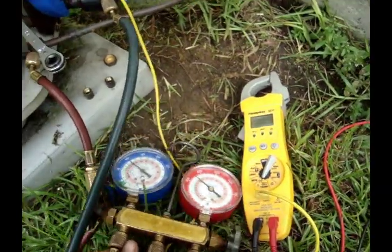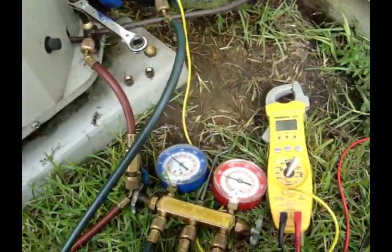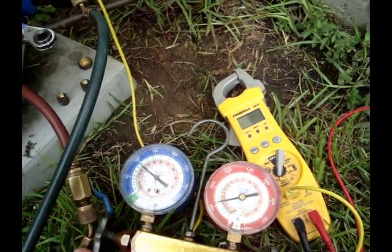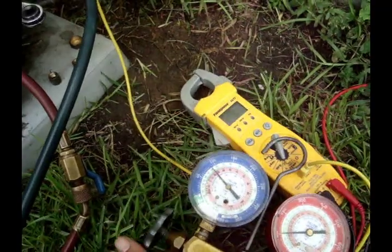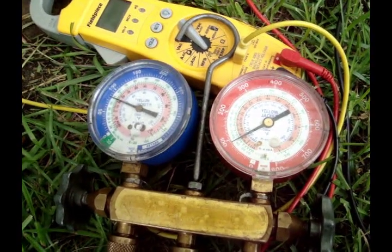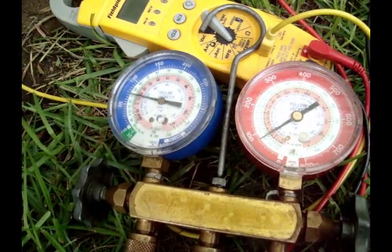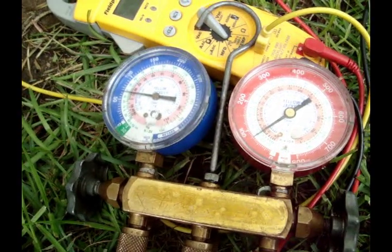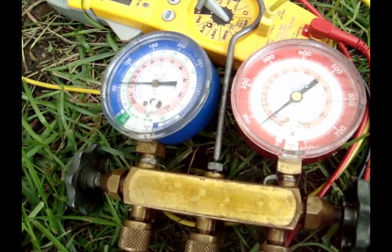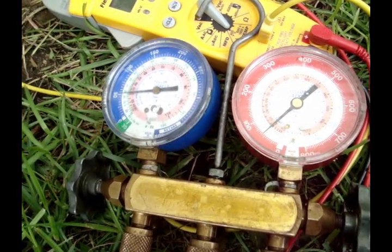What I was going to try is to pump down the unit — see if it will actually pump down. We have the liquid valve closed. I don't know if you heard the compressor right there, it made a really funny noise. It wasn't internal relief or anything, hard to describe. Just trying to pump down. Line set is about 20 feet, maybe 30 at the most.